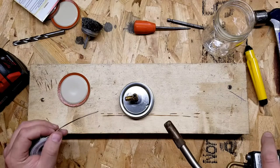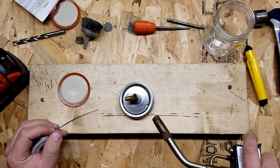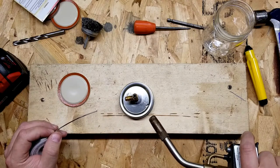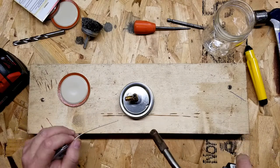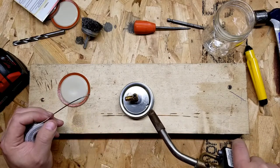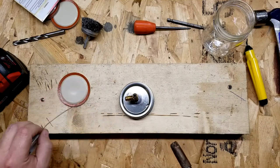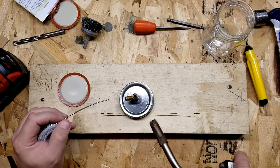Now I'm going to try and do this without getting too much heat into that sheet metal and warping it. You're watching this — I haven't done this yet; this is the first time trying it right on video, so we'll see how it goes. I'm going to try and concentrate most of the heat onto the brass, because that sheet metal is not going to take much heat at all — it'll warp and it might ruin the rubber sealing ring around the inside. So let's give it a try.